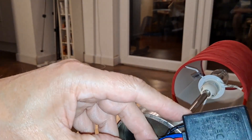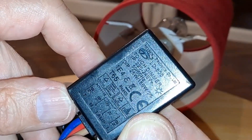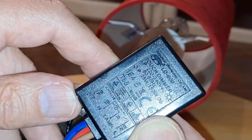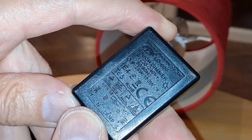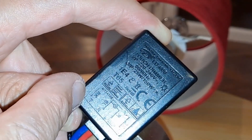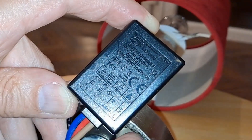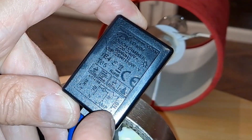You can order these modules. This one is the LD8 LD600 touch dimmer. Here in the UK: 220 to 240 volts, 25 watt to 150 watt. It actually shows you on the bottom of this one which is an improvement on the ones I've bought in the past. The black wire goes to T - that's the touch. Blue wire is N for neutral, red wire is the lamp, and brown wire is live.